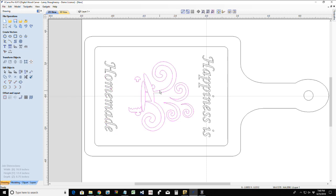I like making both styles, but the inlay cutting boards that I sell are end grain cutting boards. When I finish making and gluing up the cutting board, it then gets brought over to the CNC table. I run a face plane, a surfacing tool path, to surface off and level off the waste board on both sides down to its finished thickness, and then I will start my inlay process.